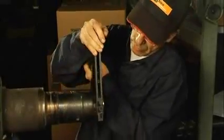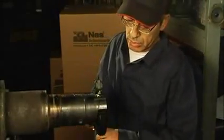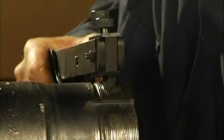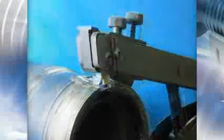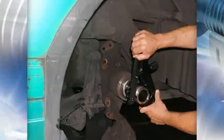The keyway skip adapter can fix these threads and fly over the keyway slot. In fact, Nest 3 is the only tool on the market that can easily skip over a keyway, saving the user from a long and aggravating job using other tools such as a thread file. The hardened blades will cut any type of metal while at the same time bringing the folded thread shoulders back to their original position. The action of fixing is easy and simple.